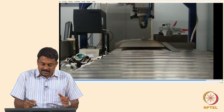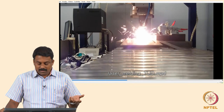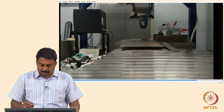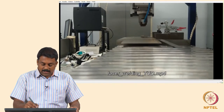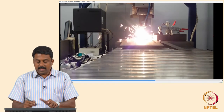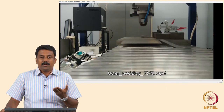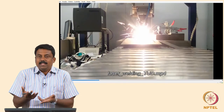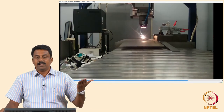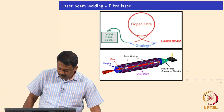Because of this very good manipulation, we can play around with lasers much more easily. To make optics simpler, in this case the laser is mounted onto a CNC table. Nowadays, you can also mount the laser head onto a robot. You do not need a very high payload because there is no real momentum for laser beams, so lasers can be manipulated much more easily.